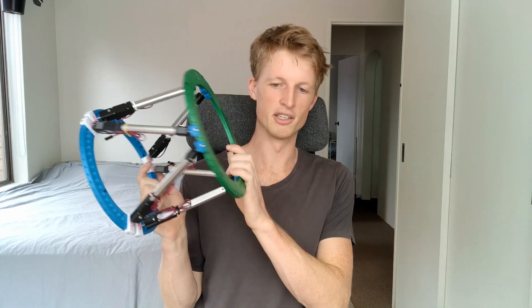So parallel manipulators seem pretty good. However, they have the downside of having a much smaller working space than serial robots, so they can't move nearly as far given how large the robot itself is. Since Jugglebot doesn't really need a tremendously large workspace and precision and repeatability are critically important, I have made a six degree of freedom parallel manipulator to be Jugglebot's arm.